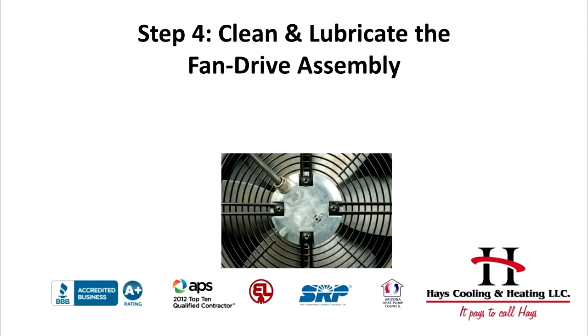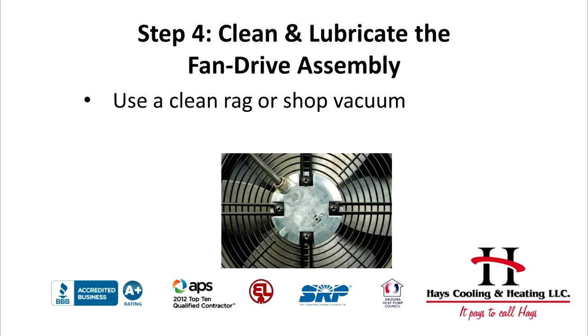Step 4. Clean and lubricate the fan drive assembly. On top of an HVAC unit, there is a rotating fan known as the fan assembly. You'll want to clean this with either a clean rag or a shop vacuum to remove all loose dirt and debris from the fan. You should also apply some lubrication oil to the appropriate parts. However, it is recommended that a professional HVAC air conditioning service in Phoenix complete this step.